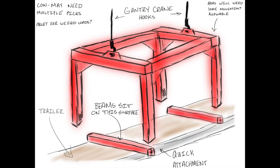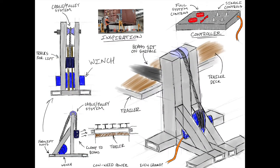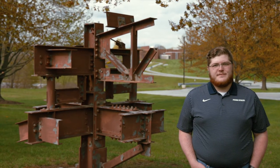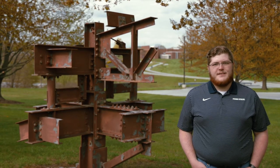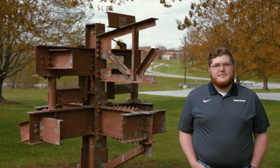From here, we looked at other heavy lifting applications for inspiration. We also looked at Kinsley's competitors to determine other ideas such as the U-shaped and C-shaped designs. Finally, we looked into a way that cargo containers are lifted to come up with our jack design concept. We then met with the customer to select the most cost-effective, efficient, and safest design. He selected the U-shaped design with more research, and we then decided to use a spreader beam as well.